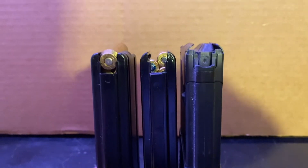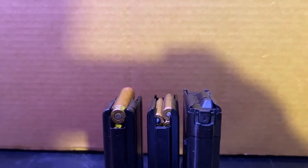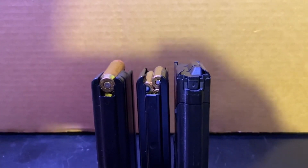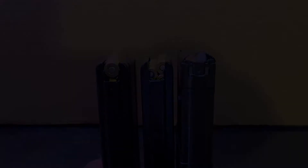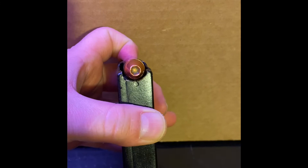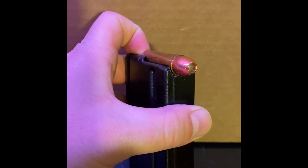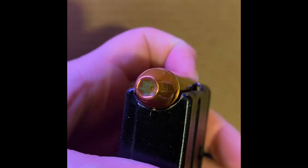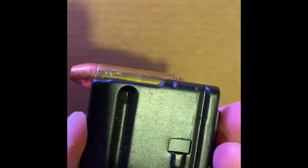The reason we're doing this is because standard AR-15 mags are not going to feed your 50 Beowulf rounds correctly — they're going to either jam up or scar up your brass. So here I basically show you why I dremeled out that area right there, because that round needs to feed through there.